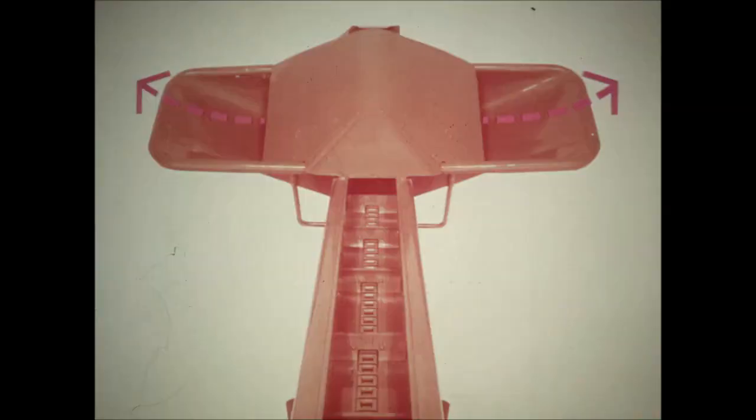Ears are moved quickly off the rolls into the wide throat of the main conveyor. A single roller chain carries them over four rubber rolls for clean husking. The husk auger works any shelled corn through perforations into a second auger which delivers kernels to the hopper. In the roomy hopper, a powerful cleaning fan blows any loose trash out to each side away from the wagon.